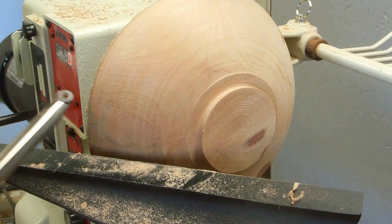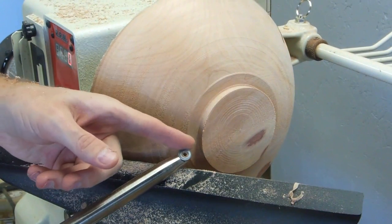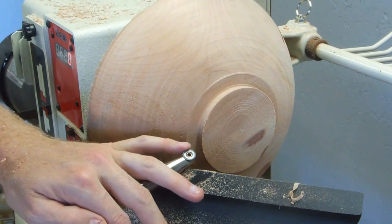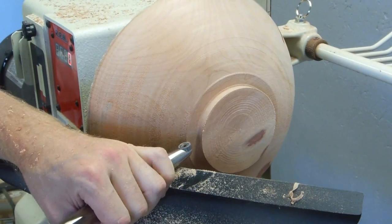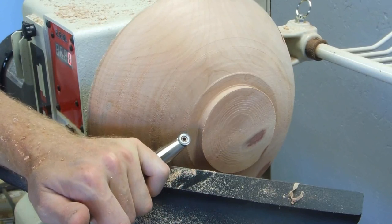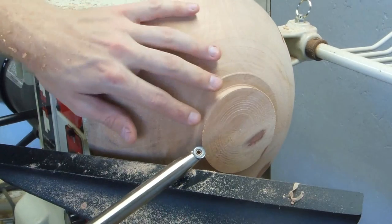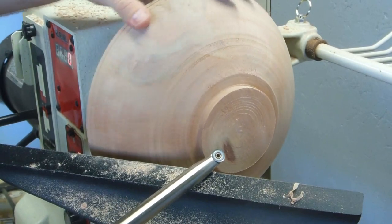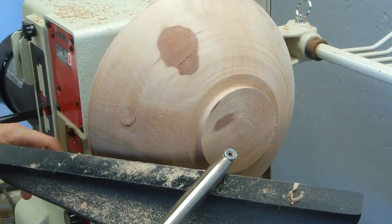If you've been watching my channel, you will recognize this tool. We've used it before. It's just a round carbide cutter, but this one is cupped. It's not flat, so this one doesn't do a scraping motion. This is actually a shear cutting action if you hold it at an angle here. And again, I've mentioned this before, but I'm going to do some SJ Wood Shorts videos about all the different shaped carbide cutters that I have. This is one that I always use for a finish cut because it leaves a pretty smooth cut, and hopefully it gets rid of a lot of this torn end grain because I don't want to sand through all that stuff. So it's going to do the final shaping and cutting here.